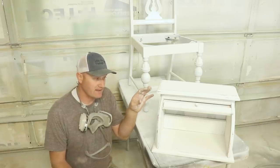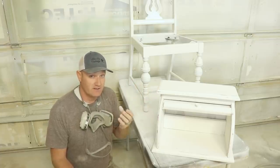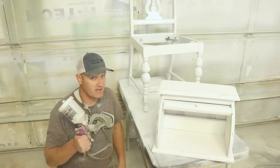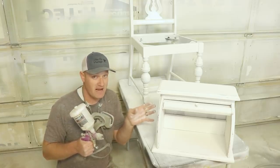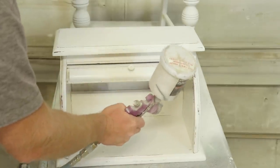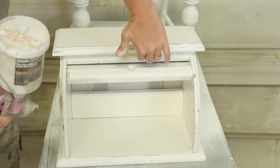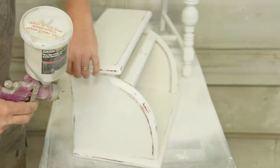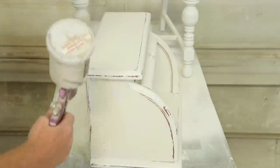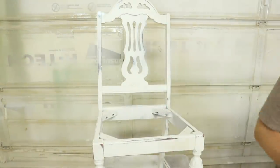Most chalk type paints, and especially the DIY clay based paint, are porous and require a sealer so water won't wipe them off. We use Sweet Pickings top coat — it's a matte sealer that gives a sheen similar to the flat paint. Most paints and sealers I spray at about 65 to 75 PSI. The only time I worry about over-atomizing is when using a glossier sheen like semi-gloss or full gloss.